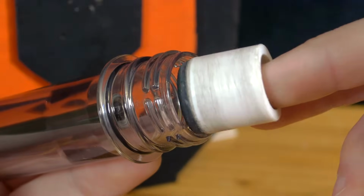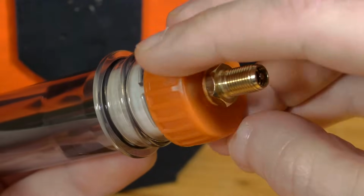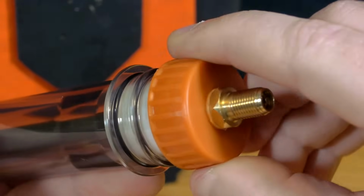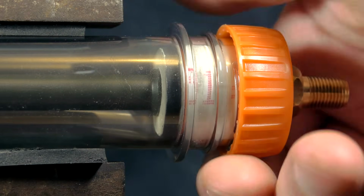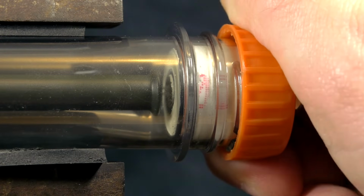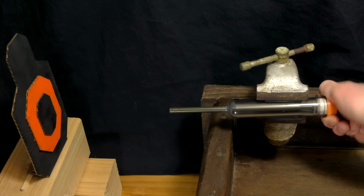I first need to begin work on the design that will be powered by compressed air. This will use a coaxial piston valve to fire the darts. The concept is that high pressure inside of the chamber will force the face of a piston to seal against the barrel. When the lid is cracked open, air escapes behind the piston, pulling it away from the barrel so that all the remaining high pressure air blows out the projectile.